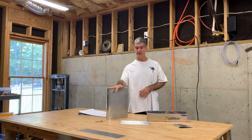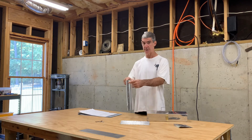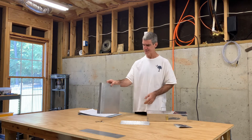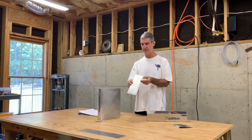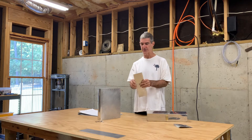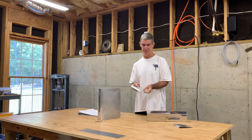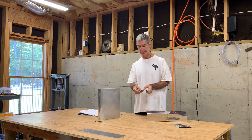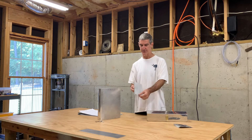For the aileron practice piece, it comes with everything you need to build it. This one is not pre-bent — one of the steps is to bend the leading edge of the aileron. It also came with some aluminum angle and a couple of pieces of sheet with different rivets to try. It's just a thing to practice on: practice drilling, match drilling, counter-sinking, dimpling, and then some pop rivets, some standard rivets, and flush rivets.